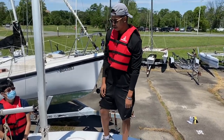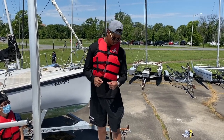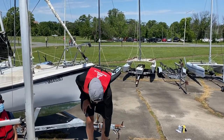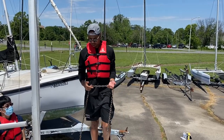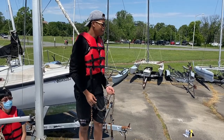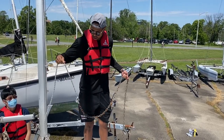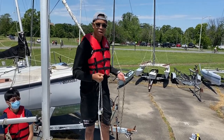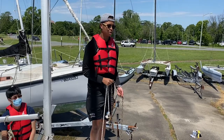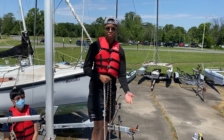Right here we have our figure eight, which helps keep the line from getting caught up and tangled against itself while we drop the anchor into the water. If you get high gusts of wind, the rope would bring the anchor up and it would start coming out of the mud, because the rope is so light. But having the chain on will help keep the anchor in the mud because of the extra weight it adds, which you will see later in this video.